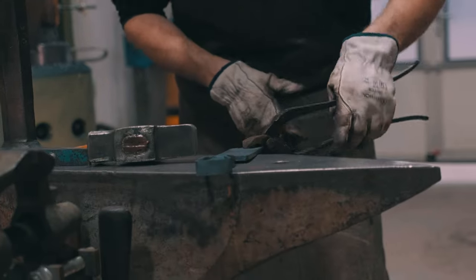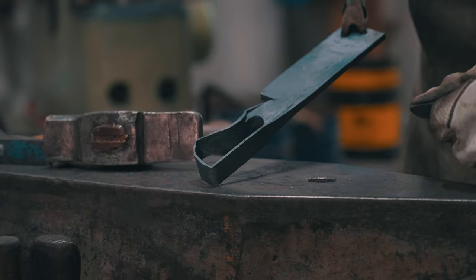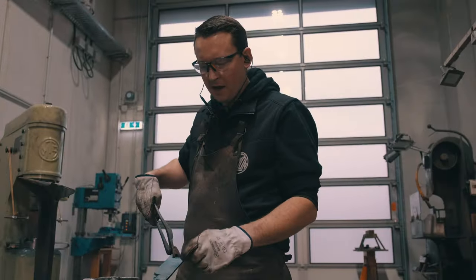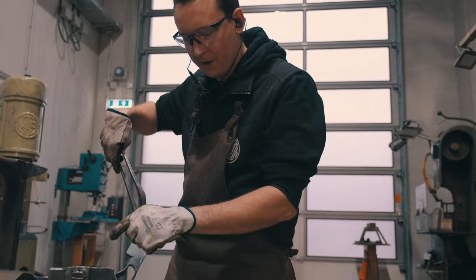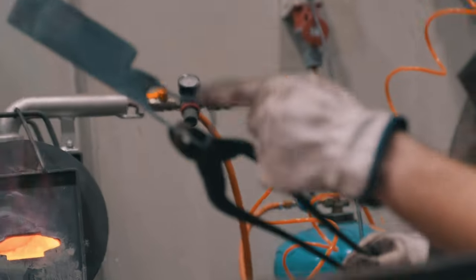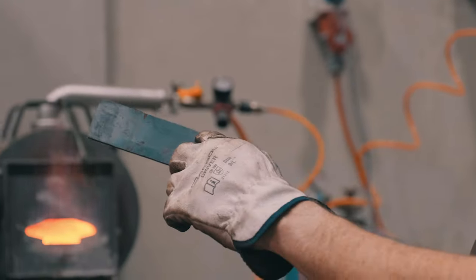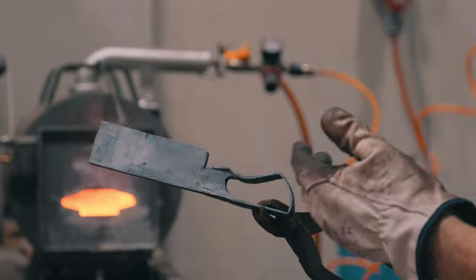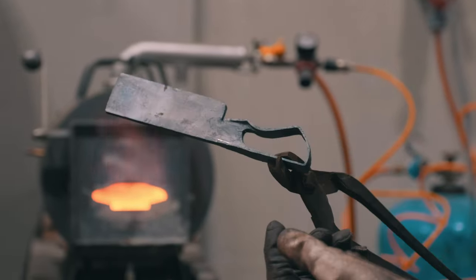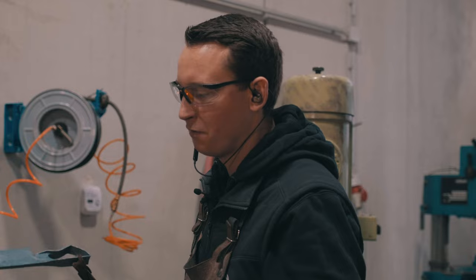The handle forging is done. Once forging is completed I'll normalize the blades, then soft anneal the whole knife. When the steel is soft annealed I'll still shape the handle a little so I can really work those edges out and make the radius perfect when the steel is cold and soft. The handle is forged out like a tang and then shaped back — there's no forge welding, it's always been one piece. Maybe not the easiest approach, but a lot of fun and one of the more interesting approaches.